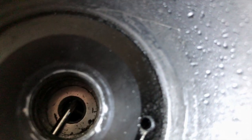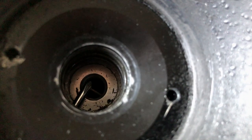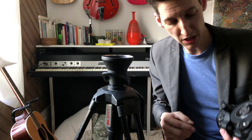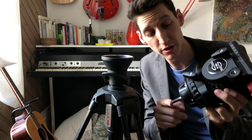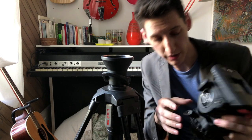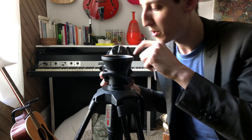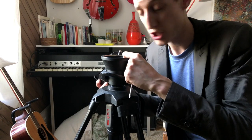The threads at the end of your head have to go inside this hole. However, as you can see, it's a moving part, so it really isn't that easy. First thing you want to do is make sure that your pan axle is locked, because otherwise you're going to play with the head and it's not going to work — the screw is actually going to turn the pan, which is not what you want. So first thing is that you align the screw with the inside of the threaded shaft in the ring.